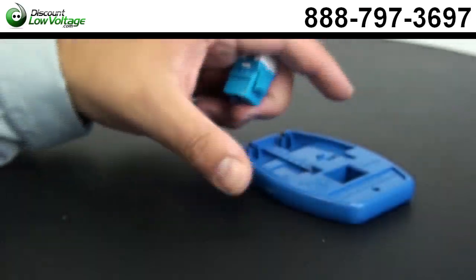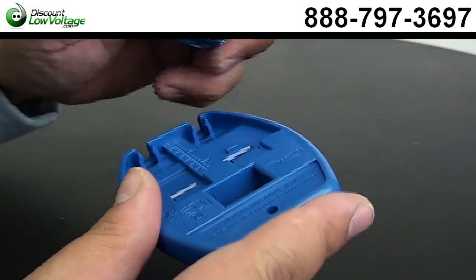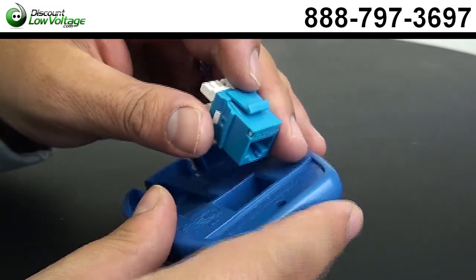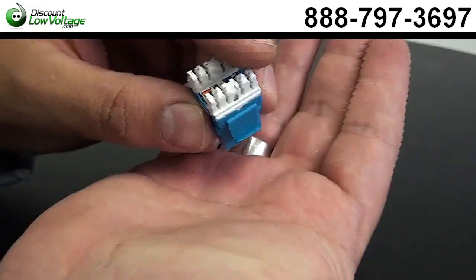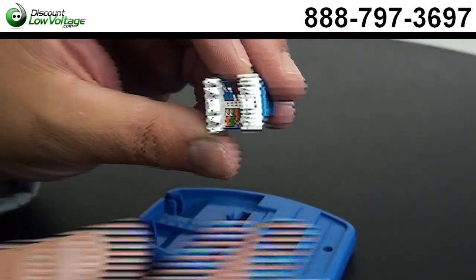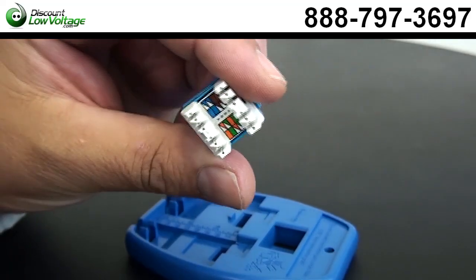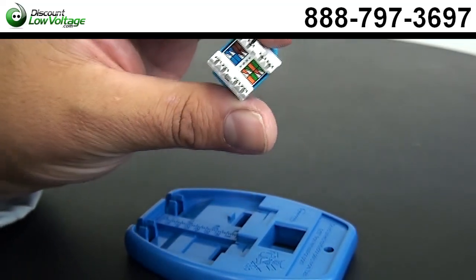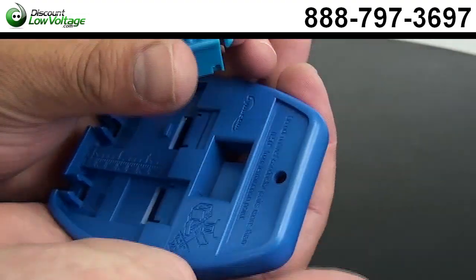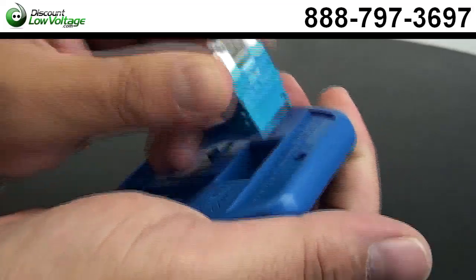You'll want to get yourself a palm puck. What this tool does is it saves you from possibly getting cut on your hand. I've seen some guys punch these down on their hands, or punch them on the wall and leave little indents on the drywall from the jack — that's definitely an improper way of doing it. With your palm puck, you just pop the jack right into it.